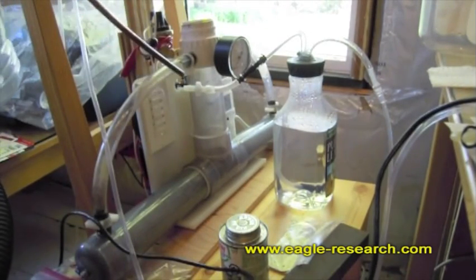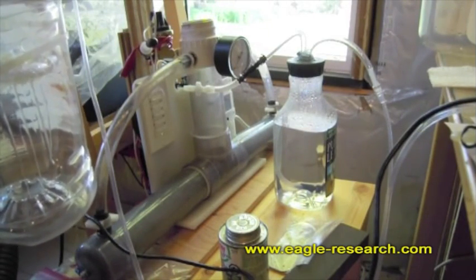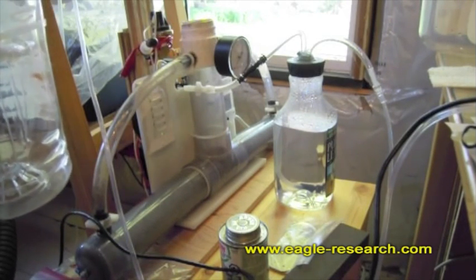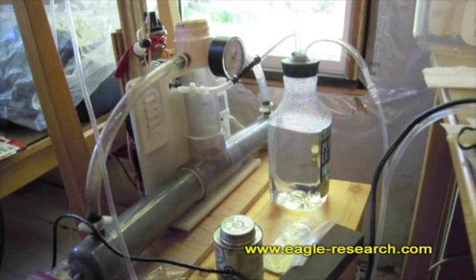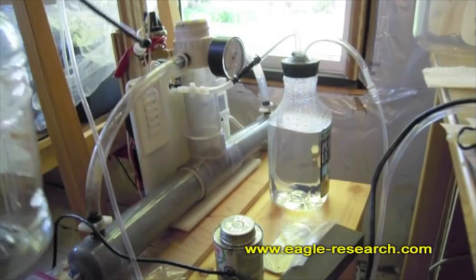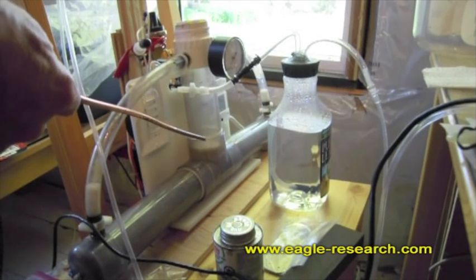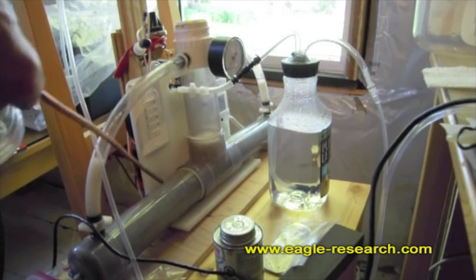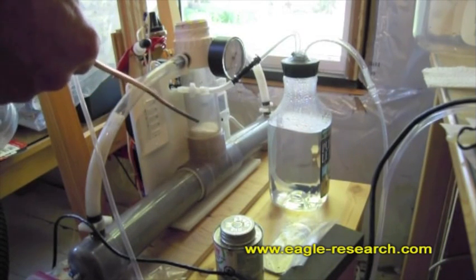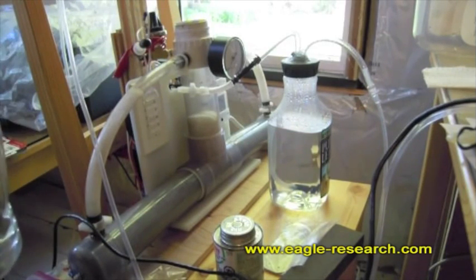This particular electrolyzer has gotten a foaming problem again, which seems to come in with any kind of oils. It seems like quite a bit of water has oil in it or some sort of impurity — even distilled water when I put it in can cause foaming. We'll start the electrolyzer and as you can see the foam level is starting to rise. There's so much foam in the tubes that it's actually pushing water up the tower and the foam is rising on top of that. We'll let the foam rise up a little and then turn on the vacuum and do some defoaming.